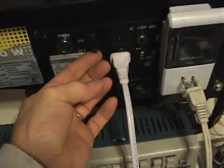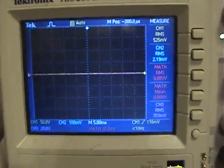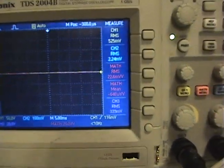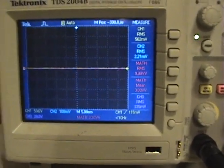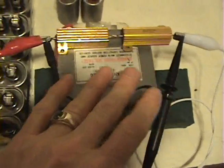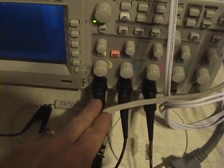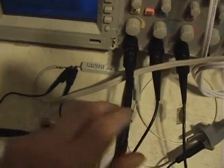I'll be turning the circuit on by turning on this switch here. We're going to look at not just what happens at this watt meter, but also on the oscilloscope to see any fine details and changes in the power that the prime mover consumes. I've also got a scope probe on channel 3. On channel 1 we're going to be monitoring the grid voltage to the induction motor, and channel 2 is across the 0.1 ohm 5% resistor.